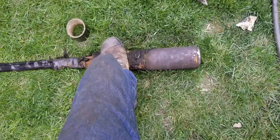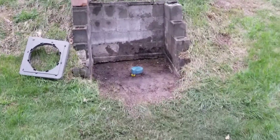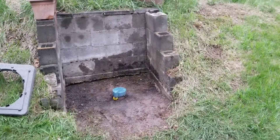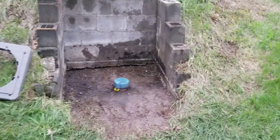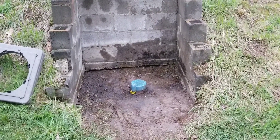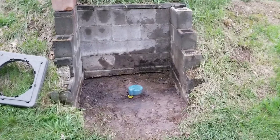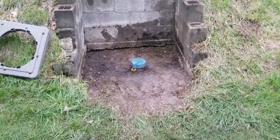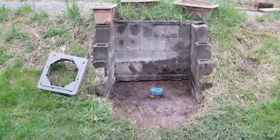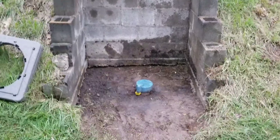As you can see, I get into a little bit of everything. Well, there it is, all done. I tried something different at the end — the last two or three times I flushed it. I think I ended up flushing it 11 times. But the last two, I really got the dirt out. What I did was I got a reserve of about 30 or 40 gallons of water, put the garden hose back down the well, and used the water to stir up the sediment at the bottom. When I hit it then, my son said it looked like an oil well — it was black. We did that a couple times, then I ran out of water, so I hit it with air a couple more times and then we buttoned it up.